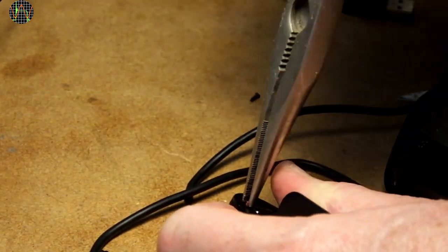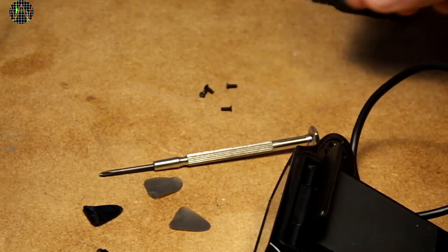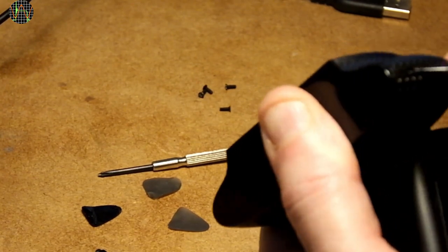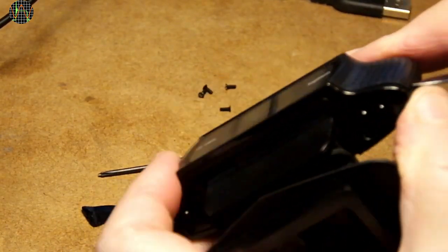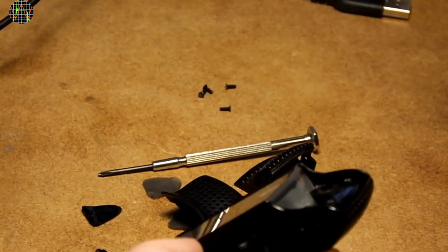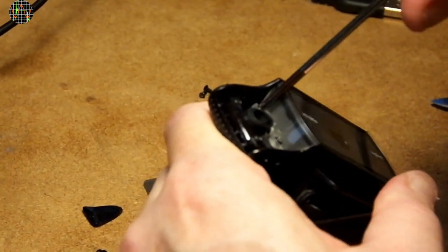I needed all kinds of tools to get them out. These four are finally out but pretty chewed up. Unfortunately, Kurokesu's instructions are to reuse these screws later when putting the PCB into the new housing. With these screws out, the next task is to remove those plastic edge panels — another prime opportunity to stab yourself. Now there are another four screws on each side to remove. This thing contains an amazing number of screws. Luckily, these are slightly easier to remove than the first four.